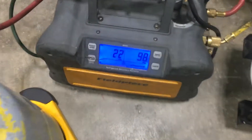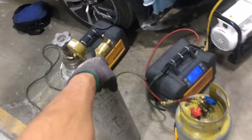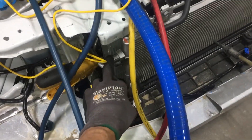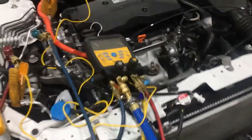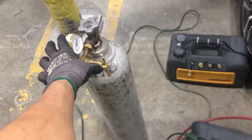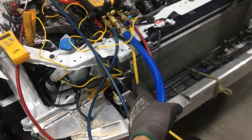And I'm holding pretty good. So I'll charge it up with nitrogen — I'll put dry nitrogen into the system because it's in the vacuum. You never want to — and I stress this in many of my videos — do not open up your refrigerant lines after you just recovered it. You're in a vacuum and you're going to draw in moist air. Always back it up with one or two PSI of dry nitrogen and then break your fittings.